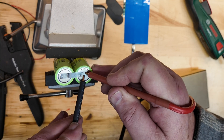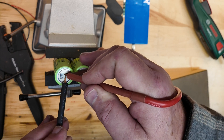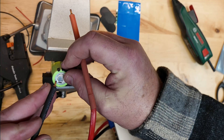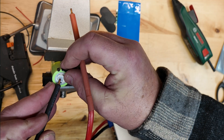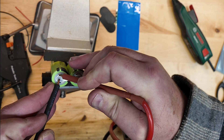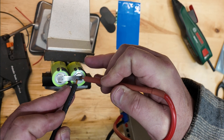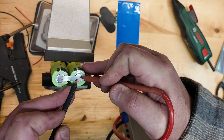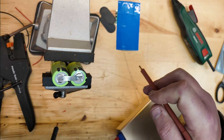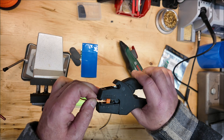There really is no structural reason to do this. This pack's never going to draw more than a couple hundred milliamps, so we're not racing slot cars or RC cars. I'm going to do the positive end now — get some good spot welds here. I'm going to go with four on this end just because of the space limitations. There are already plastic rings on these ends of the battery, so I don't need to add them. Otherwise you'd want some protection against the bus bar potentially touching the case of the battery.